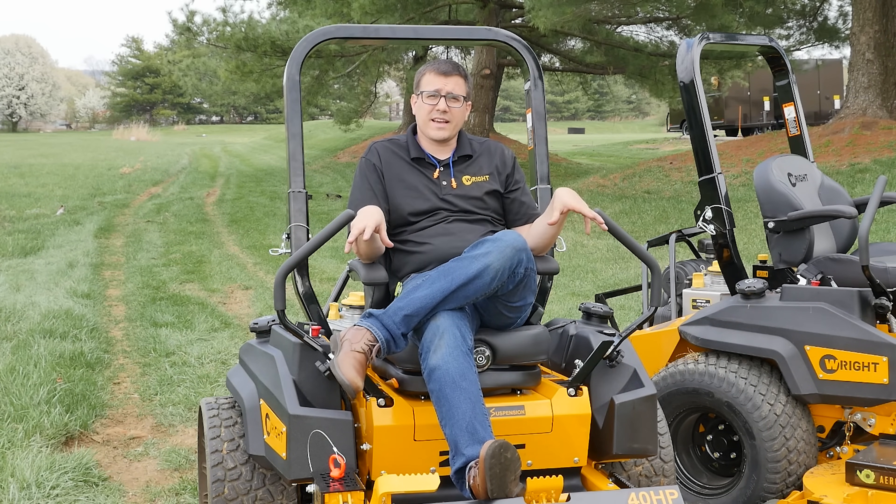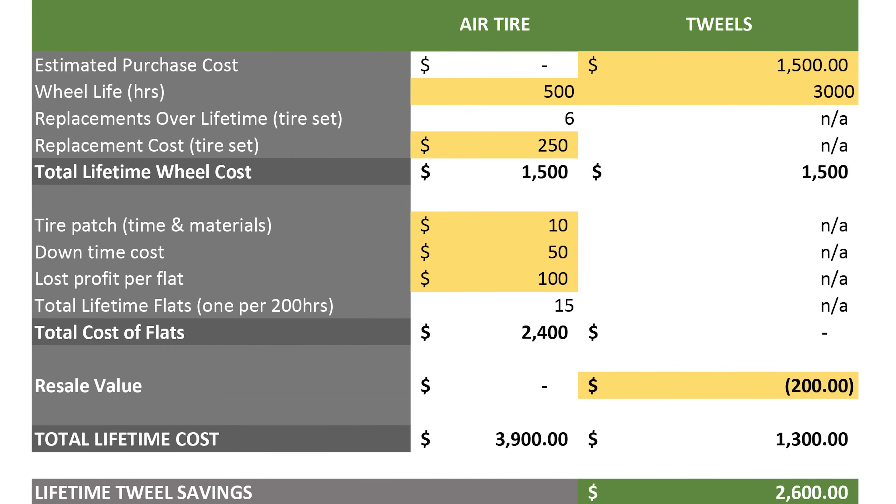For a bigger machine like this with 26-inch tweels, it might cost around $1,500 to equip your machine with tweels. On a smaller machine, that might be closer to $1,000 — it really depends on the tire size. That is quite expensive for wheels, but if you look at total life cycle cost, which is a lot of how we design our machines, you have a lower net present value buying tweels than running air tires. You might go through four or five sets of air tires over that time period, which has an expense to itself, plus taking the machine out of use to get tires swapped out. With tweels it's one and done.